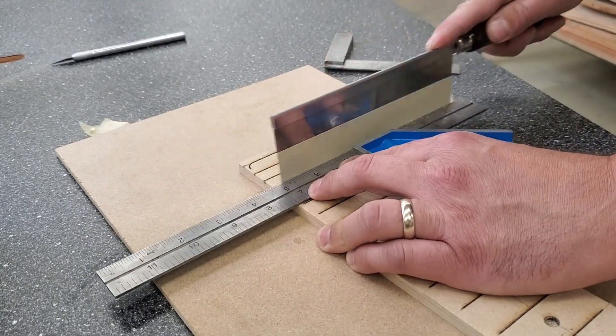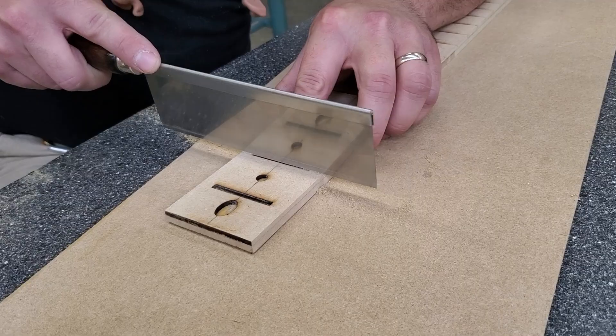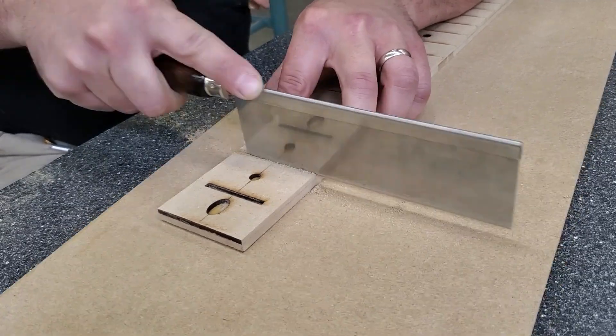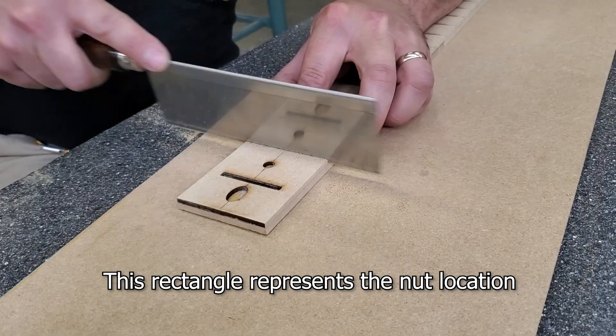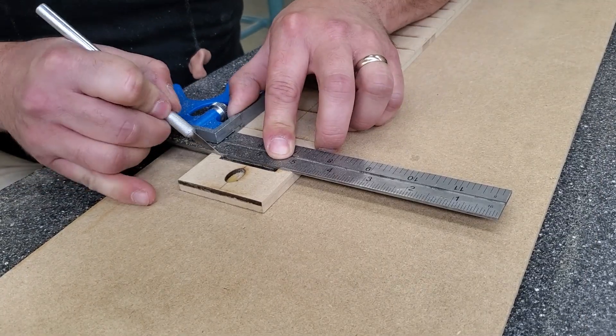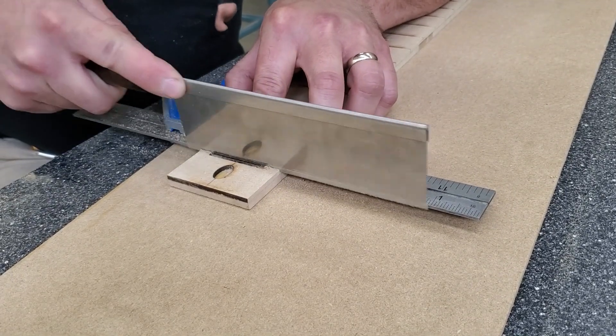This is all still part of making a jig — it's not just tracing onto a piece. This jig is going to fit in a custom miter box that I'm building, and it's going to have little locator pins — in this case, an old hacksaw blade as a locator. You'll see how that works really soon.